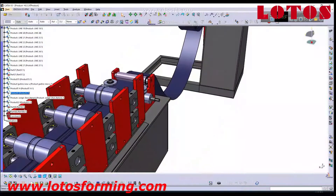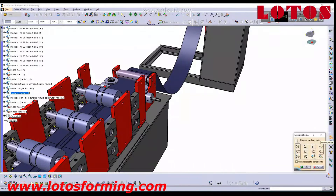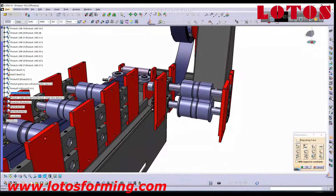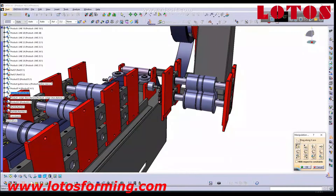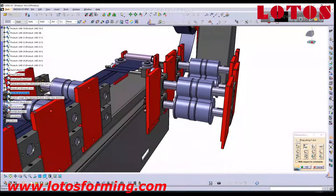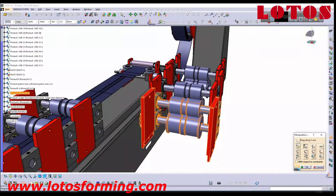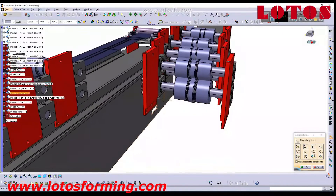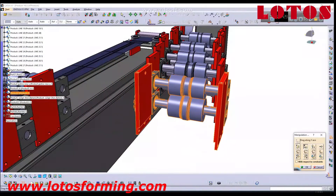Let me turn on the machine for you so you can see the overall view. I'm going to show you the roller design. For designing this shape of roller, the down roller should be the same diameter throughout, because for chain transmission all the down rollers are connected and must share the same diameter. Taking them out one by one, you can see the difference between the up roller and down roller and how we shape the sheet.